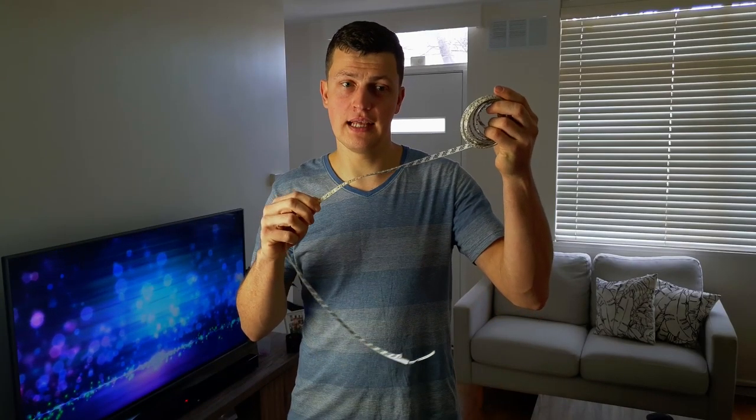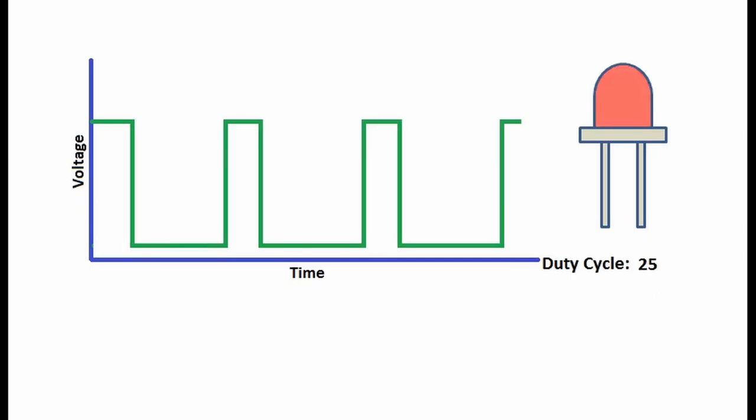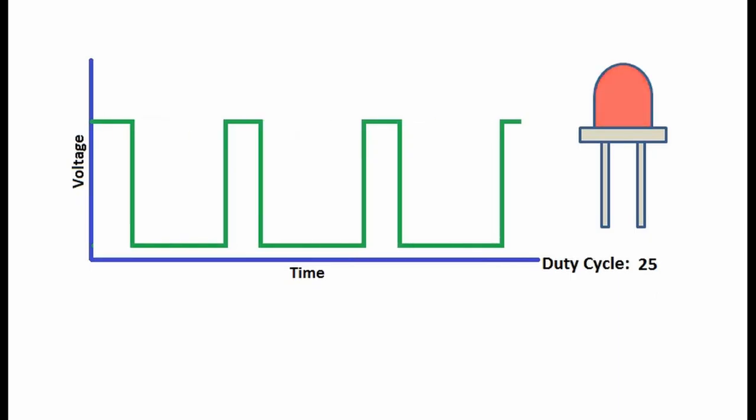Let's say you have an LED light strip like this that you want to control the intensity of. These usually run at 12 volts DC. To dim a DC load, you would need to use a MOSFET and turn it on and off really fast, tens of thousands of times a second. If in a single cycle, you have switched it on for half the time and off the other half, effectively you only deliver half the current, which in turn lights the LEDs only at half brightness. Changing the ratio between on and off time in turn changes the brightness. This is called PWM, or pulse width modulation.